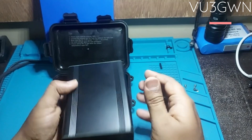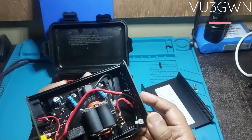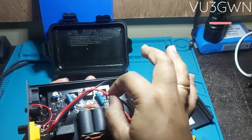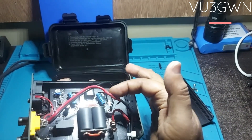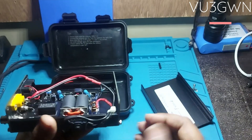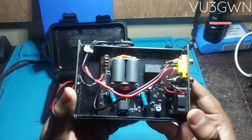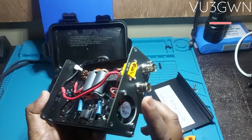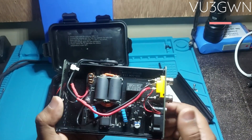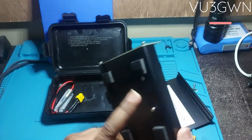Now we've opened all the screws on both sides. This is a well-constructed aluminium box. As you can see, I have not messed around with the power circuitry. All I've done is tap into the positive connection coming from the XT60 to the board, run a switch through that, and back into the board — that's it. I kept the wire black because a red wire would stand out and mess with the look of the box. The board is pretty simple — it doesn't have a PTT switch to trigger the amplifier; it uses an RF relay that senses incoming RF and triggers the amplifier to kick in.